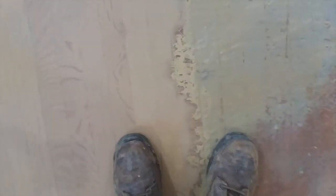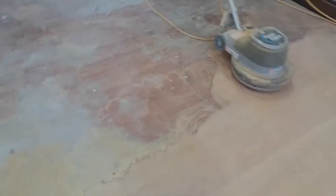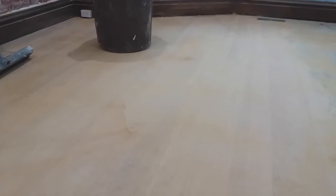It's not just flying off — you've got to sit there with the diamond brush for a little while and let it do its thing, kind of work it back and forth, but it gets it off. It's doing a great job. What you're left with is a really rough sanded floor, so you still have to go hit it with two or three levels of sandpaper.